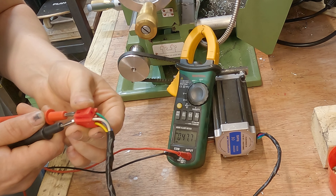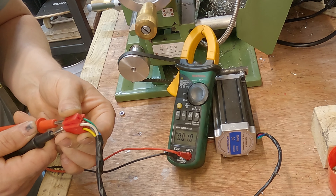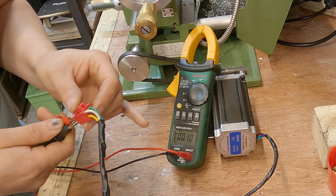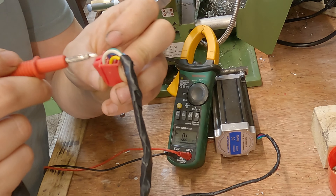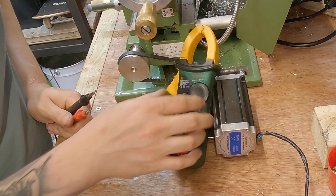We've found it straight away actually. We've got 1.1 ohm resistance there, and just to double-check the other ones — yeah, 1.1 ohm resistance there as well. So in my case I know that the white and green wire and the blue and yellow wire pair together. That's the first bit of information you need.